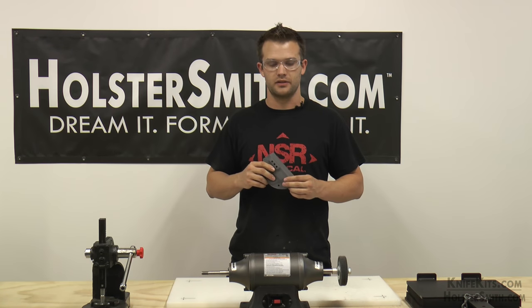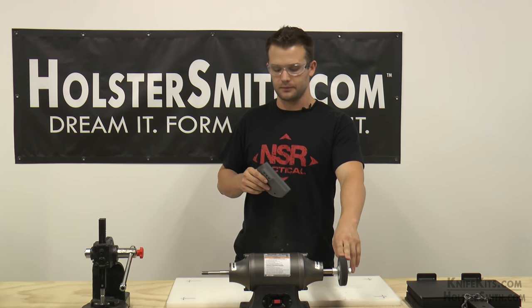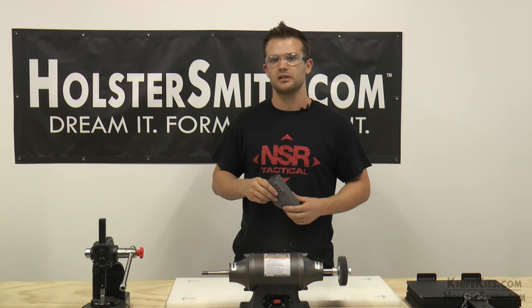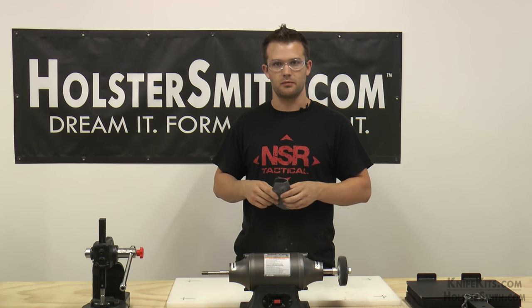All right, so that's the pre-buff stage. I was using an ultra-fine aluminum oxide wheel, a satin wheel. That's what we use. It works great for us. The next stage would be polishing, but that's going to be for another video.